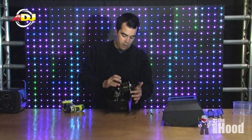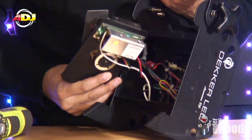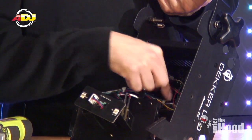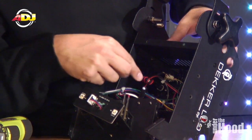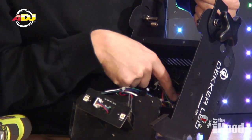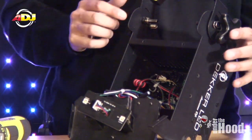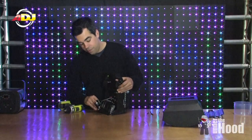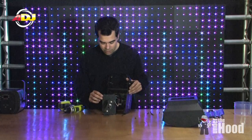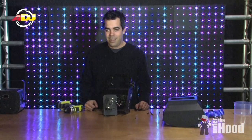This too has our 1.8 degree stepper motor. On the back you've got the power supply. Going to the main PC board, you can see all the little wiring harnesses, here's your DMX in and out, your display board, and your main PC board — it's got some E-PROMs and all that fun stuff on there. The fun part is plugging one of these things in when it's all taken apart, which is extremely dangerous, which is why they pay me to do it.